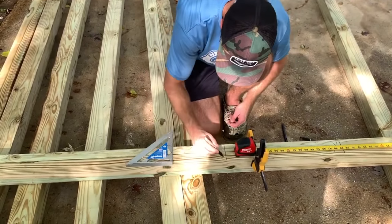If anything, you want to have the ridge flashing extending a little bit further than the drip edge, just to make sure that no water will ever get behind the drip edge on the rake edge. After cutting it to size, you're simply going to apply some more asphaltic coating underneath, which I didn't show, and once you have it in place, you're going to use nails to secure it to the shed.